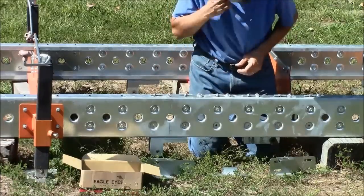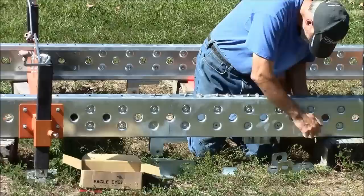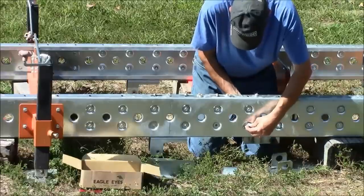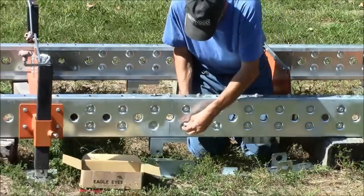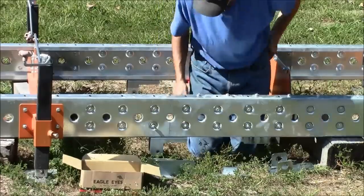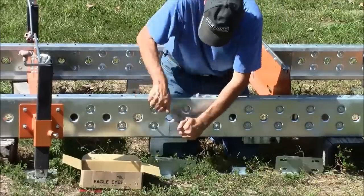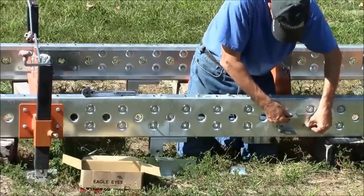Replace the 6 bottom frame bolts above the axle hangers with studs. These will hold the fender brackets and the carriage lock brackets in place. Go ahead and tighten these down with the wrench. Attach the fender brackets and the carriage lock brackets just finger tight.